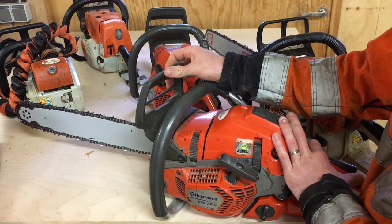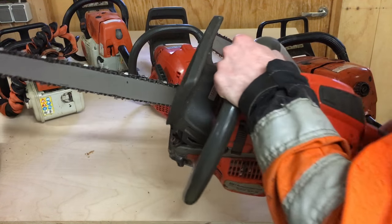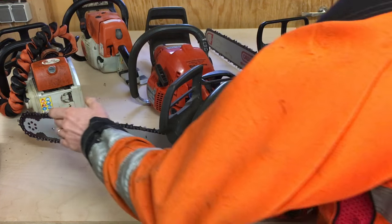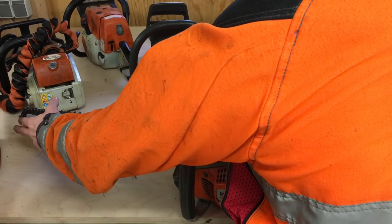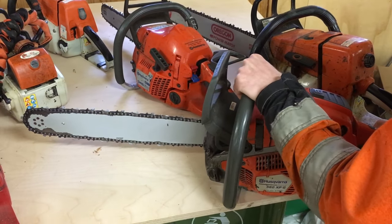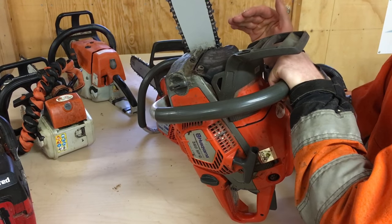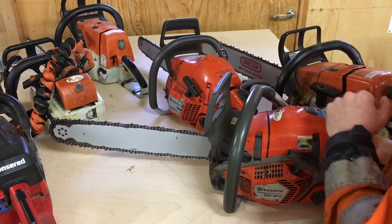We start out here with this lever — it's the chain brake, or actually the chain brake sits in here but it's activated with this lever. The way that works is if you cut with the top of your saw bar, which you should avoid, but if you happen to do it by accident there's a very high risk of your saw kicking back at you, straight towards you, because they're pretty powerful. What this does is your wrist should hit the chain brake and the chain should stop immediately. You can test this with a running chainsaw by just activating it — it should stop right away. It shouldn't keep spinning for a few seconds; it needs to stop right away if it's working properly.